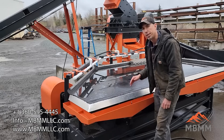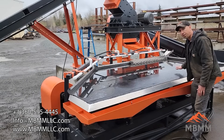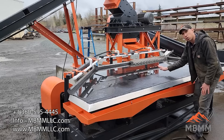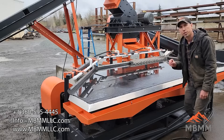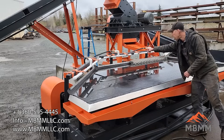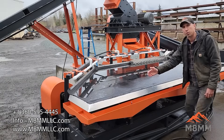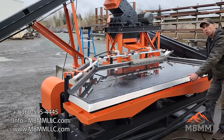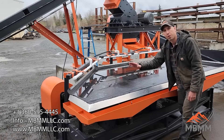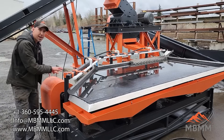This shaker table uses about 15 US gallons per minute, give or take, depending on your water needs. To get the shaker table set up it needs to be flat, level, parallel with the grooves, and tipped down towards the number 4 tailings trough at one quarter inch per foot. When set up on this table you have about an inch to an inch and a quarter difference from top to bottom, and it is level this way in parallel with the grooves. The water runs down towards number 3 and number 4, and the heavy materials work their way across the table, up the ramp, and into number 1 and number 2. This shaker table is run by a 1 horsepower motor contained under this guard, with a couple of greasers under there that only need to be greased about once a week.